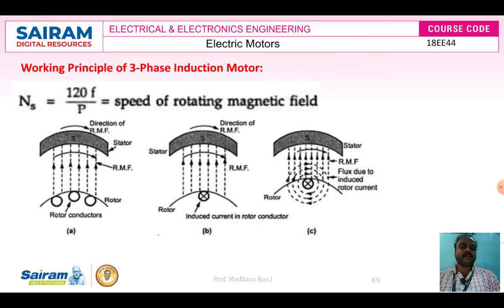As we can see in figure 3, the fluxes are induced and they cut the rotor conductors. Once the rotor conductors cut the magnetic flux, according to Faraday's laws of electromagnetic induction, an EMF will be induced — this is called back EMF. At the time of starting, back EMF is zero. When back EMF is zero, a very high current flows in the stator conductors, which can damage them.